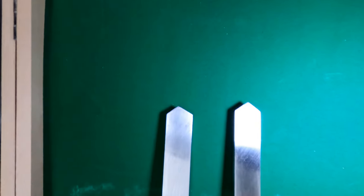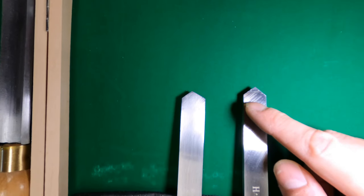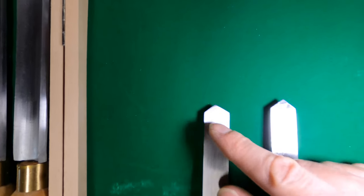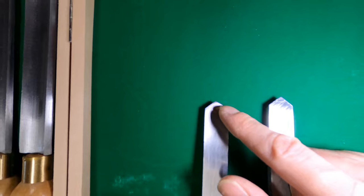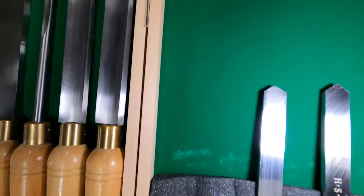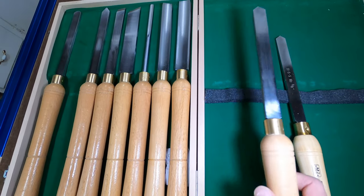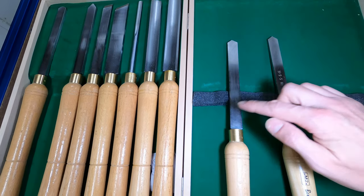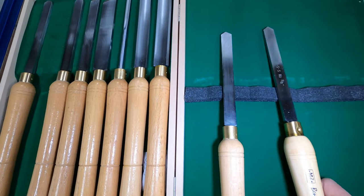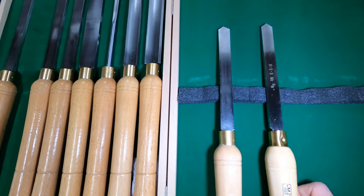Some of these are just plain nasty looking. The PSI is pretty much a perfect point triangle, and the Harbor Freight is crooked — one leg is shorter than the other. To the touch the sharpness is actually the same, but again the handle quality feel on the PSI is a lot better. The Harbor Freight is very weighted towards the chisel side; the PSI is weighted towards the chisel side but less so. I just can't believe the difference in these tips and how crooked the Harbor Freight one is.